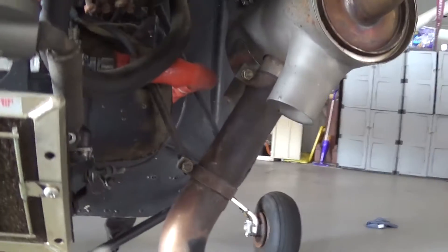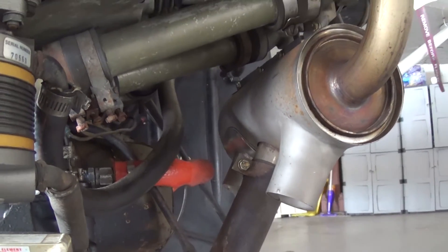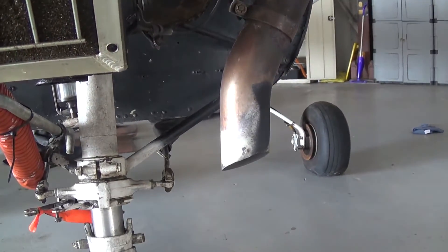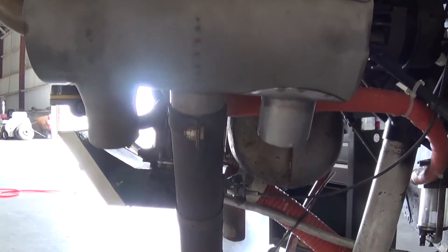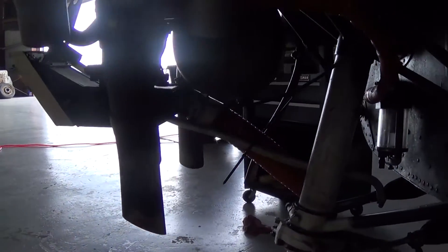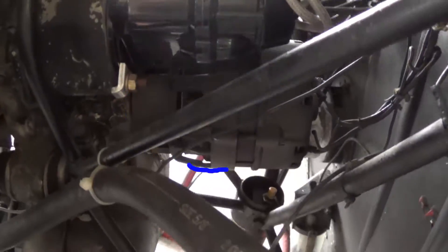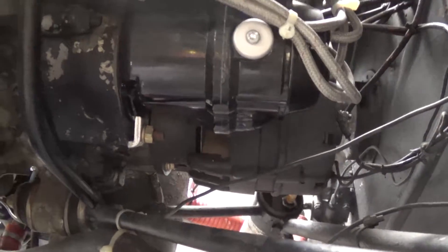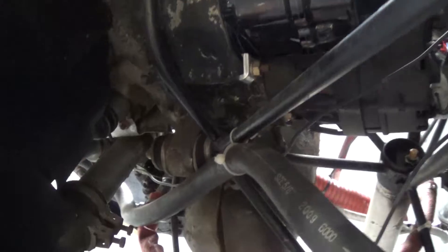On this muffler we can see how it's supposed to look with the two holes on it in the shroud — the inlet and outlet — so you actually have the inlet air that comes in, gets heated by the muffler, and then the outlet that would go to your cabin heat on this side. On the back side of the engine we can see our alternator, and the alternator is just like a pump but instead of pumping water or oil it's pumping electricity — making electricity to run our lights, radios, things like that.